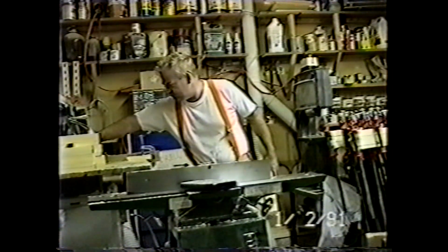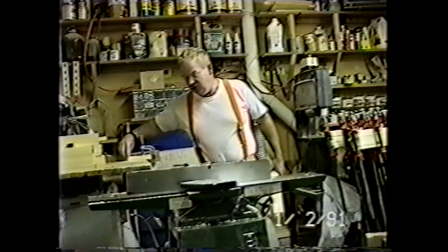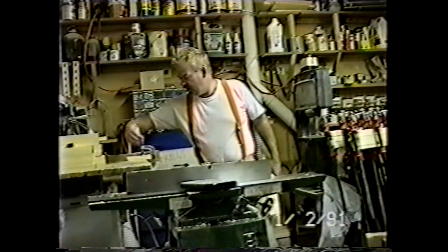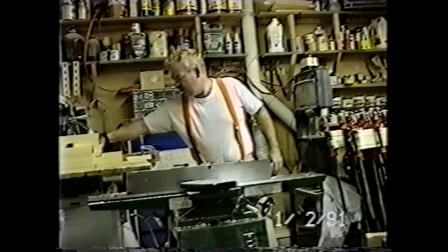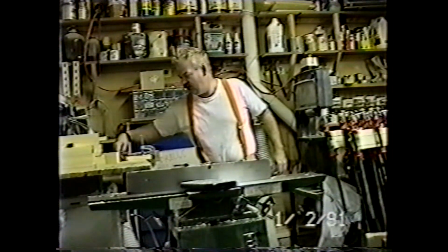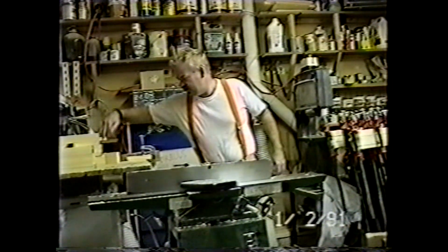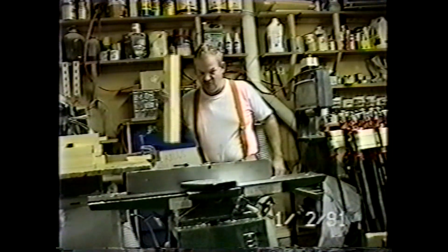Not only I had the spacers in here, so the sawdust drops in behind. But my stop block, normally I would bolt it right to the fence, clamp it right to the fence. Now it's about 1 inch away from the fence, and it's cut off at a 45. So when the wood butts down against it, it's just wood. I don't get sawdust built up on the end here and cut every one a different length because of the thickness of the sawdust that I'm building up. And there's no sawdust ever accumulates along my fence because it drops right down through because there's 1/4 inch spaces in there. That's what Norm says.